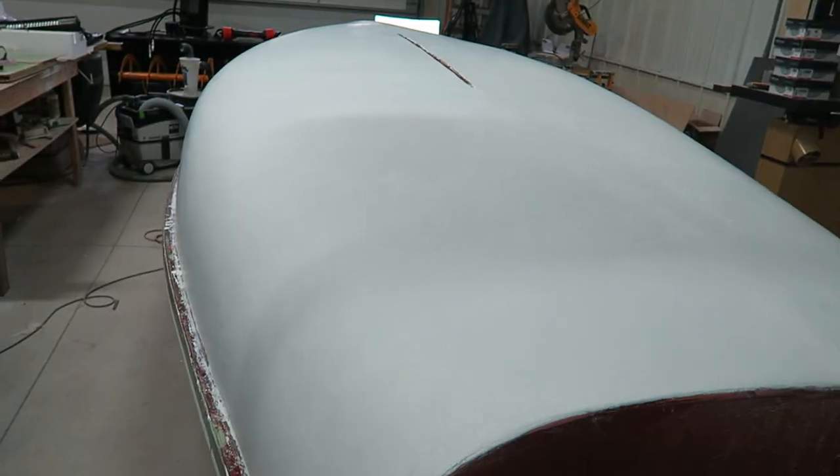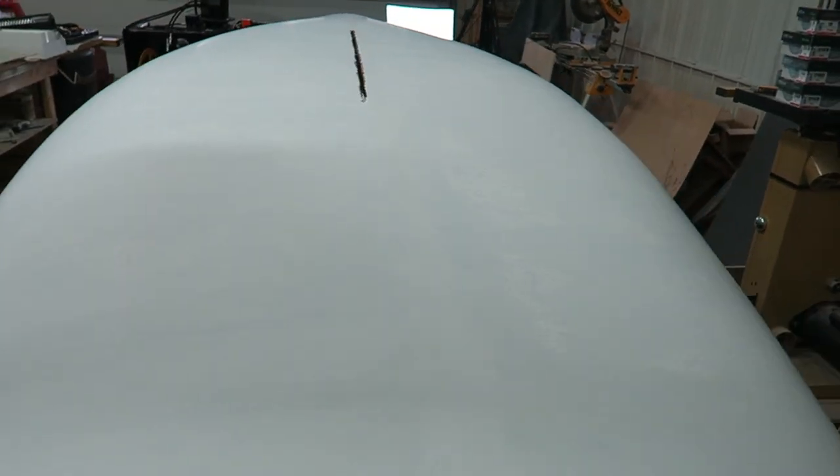Well, good morning and happy Friday for everybody over on Patreon. YouTube will be seeing this on Sunday morning. After I got the first coat of primer put down last night, I checked out and came in this morning, and because I was still within that 24-hour window, I just mixed up another batch of the 442 primer and rolled it out. Now, if I had gone over that 24-hour mark, then I'd have to sand, but timing is everything. And I gotta say, she's looking pretty sexy. So I'll give you a quick little peek at how everything is looking right now.